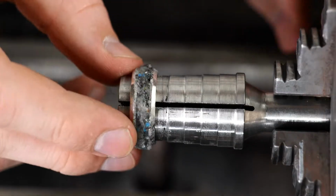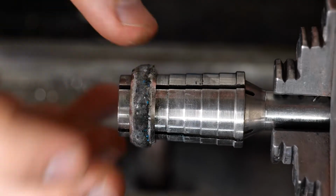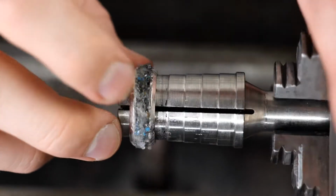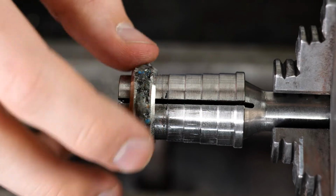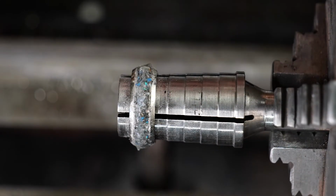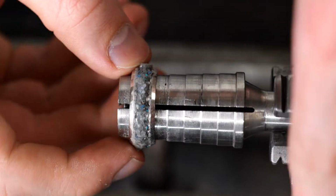All right, I filled it up to the brim with the inlay material. Then I hardened it, gave it about 5 or so minutes to completely dry. And then I decided, just in case there's any potential low points, I went in and I did one extra layer of medium CA over the top of it, just in case there's any little divots in there.